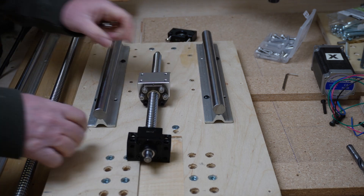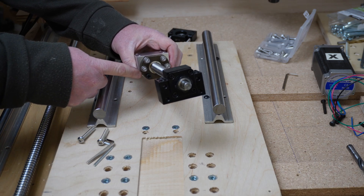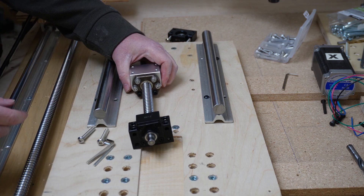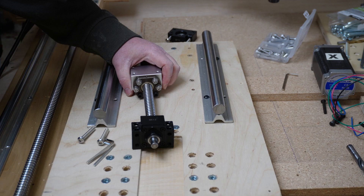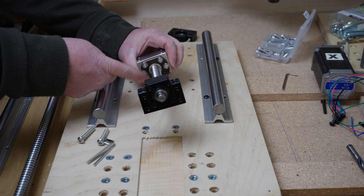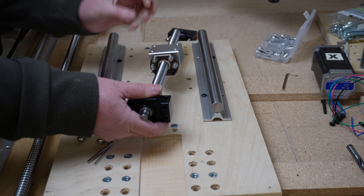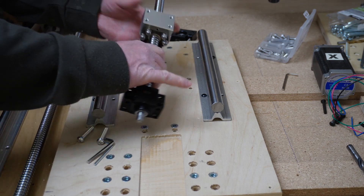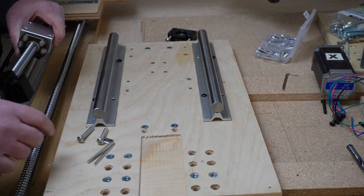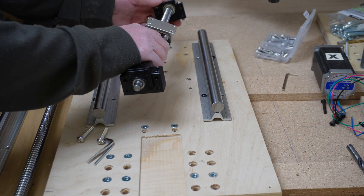When you fasten on your ball screw, I highly recommend using thread locker or a split lock washer. I've had one vibrate loose on my other CNC, and you really don't want that — especially if it's way underneath a platform on the y-axis or x-axis where it's hard to reach. So put split lock washers or removable thread locker. When mounting the ball screw, make sure the end is facing upward. Using the threaded insert makes this much easier. Always put in your BK12 first — you can set the other one on but don't screw it down yet.